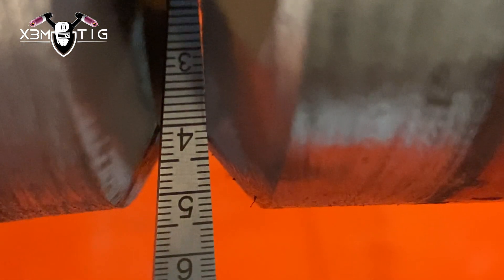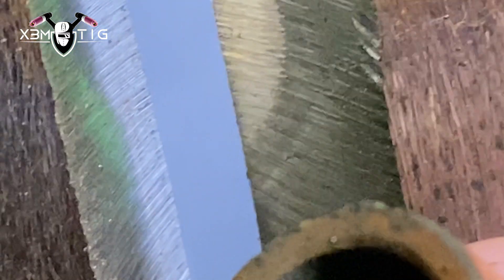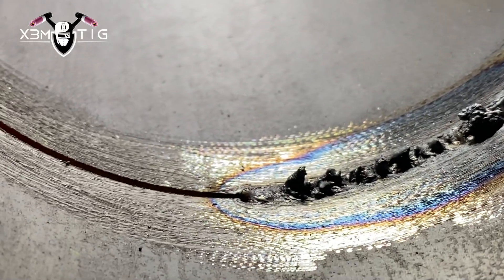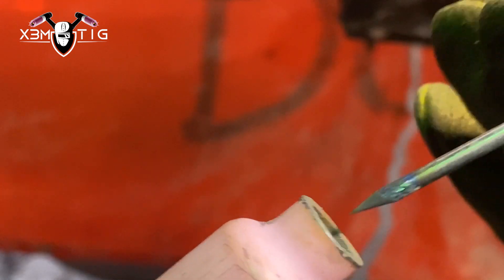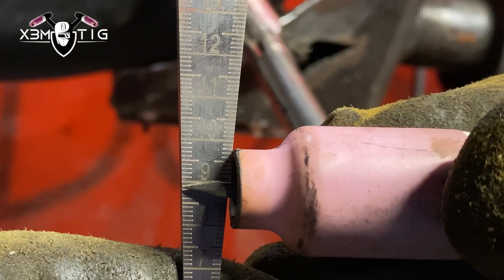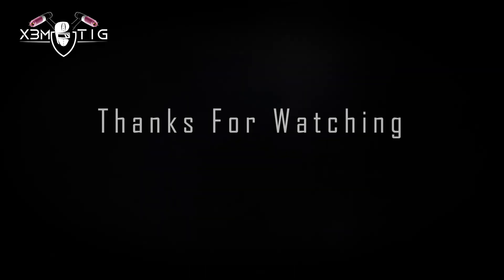That's it for the root. Once you got a nice solid root inside, that's good. As I said, the bottom is most important. Pay attention to the size of your gap, your tungsten — don't go too much on the sides. Don't rush before that puddle or before that rod opens that side. When you dip the tungsten, change it — you don't want to weld with contaminated tungsten. That's what we want to avoid — it'll fail not only x-ray, it'll fail visual. Always keep sharp tungsten, cup size, amperage, and stick out in mind — that's your starting point. Play with your amps — even if you go below 100, probably change to a 1/16 tungsten. Okay, that's it for today's video — see you in the next one, hope you like it.